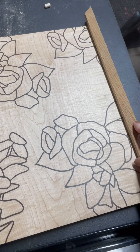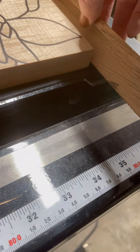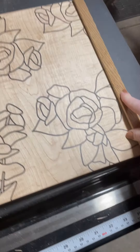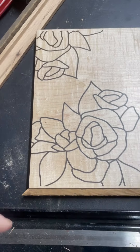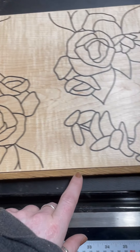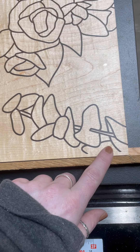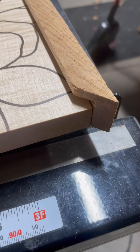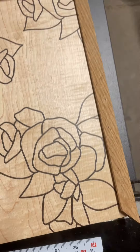Then when you bring it back over to your sign, you've got your miters. Instead of measuring, you can just slide it up next to your sign and mark where you want to cut, then go back over to your miter saw and cut your angles. One trick I like to use when cutting my angles is that you want the shorter side to be the same length as your sign. Now you can see that's what it's supposed to look like, and you need to repeat that all four times.